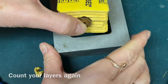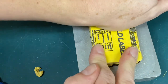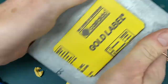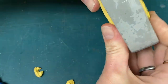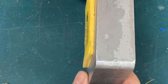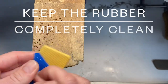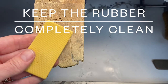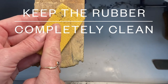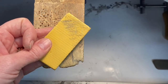I have nine layers for my mold — this is important because we vulcanize seven minutes per layer. So nine times seven is 63 minutes for my total time in the vulcanizer. Make sure you even out your mold with two extra layers, one at the top and one at the bottom. While preparing your rubber mold, be careful not to drop a piece on the bench or pick up any dirt — anything embedded in the rubber will be there after vulcanizing and will cause issues when injecting wax.